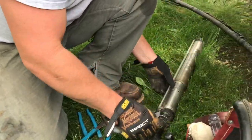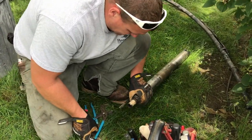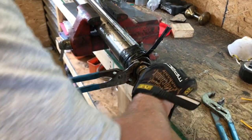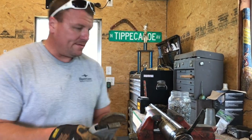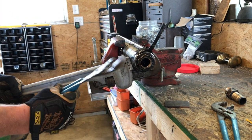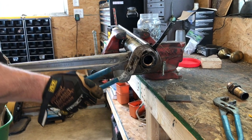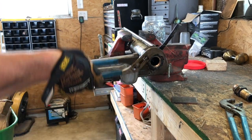So you're going to take the pump with you when you go get the new one? How long do well pumps typically last? I don't know — our other one lasted about 40 years, maybe. I guess it depends on usage and what kind of condition they're run in. This one didn't have a check valve on it, which I don't really understand. I don't know if there's an internal check on these pumps, but I'm putting a check valve in it.